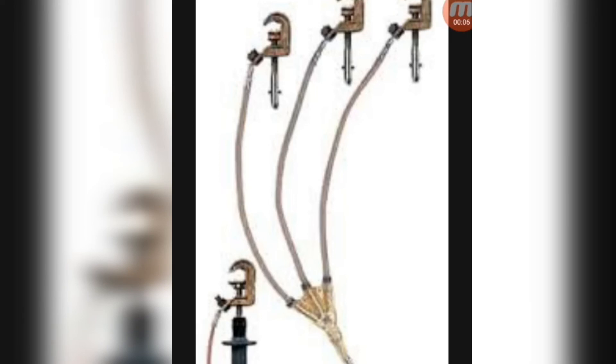The third basic rule for line isolation safety is the installation of a short and ground. The short and ground is used so that if any extra charge is available in the line, it will be discharged. Also, the short and ground is needed because if you checked the line five minutes ago and then someone goes to the station and operates an isolation switch, the short and ground gives you protection. That is the third safety rule: short and ground.